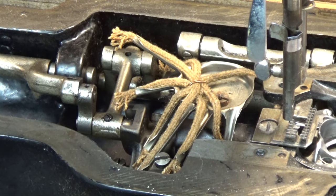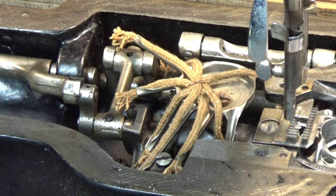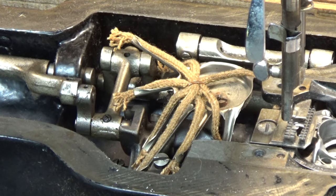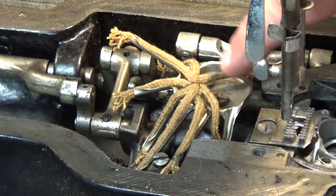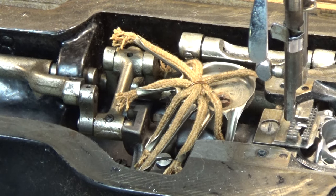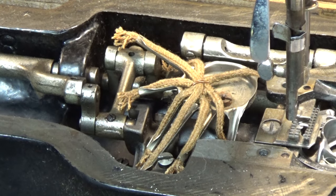And so if you happen to own a 101, whether it's a dash 4 or otherwise, do not be deceived in thinking that okay, I'm going to put those 12 drops of oil, like I heard Scott mention, through that little hole so it goes into that little cup, that little cup that is right here, and that's going to be sufficient to make my machine run at a reasonably optimal level. There are so many pivot points that this wicking system misses. So many pivot points that I would strongly encourage you to service those pivot points yourself.